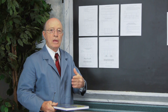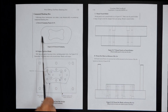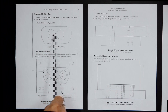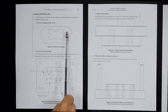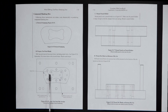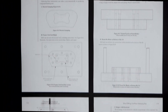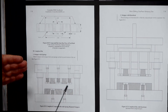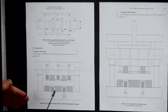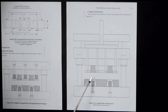This is a revolutionary method of producing these dies. Take, for example, this compound blank that you want to produce — this is a cavity inside, just a steel plate. The book gives you the instructions on how to make the piece. Here you have the starter holes — that's where the wire goes in. The wire EDM would automatically put in the tapers. Once you put it together, it would automatically line up. You can produce it with springs or with positive knockout.